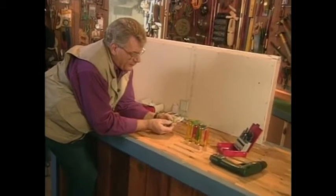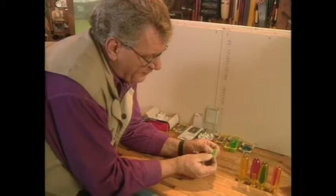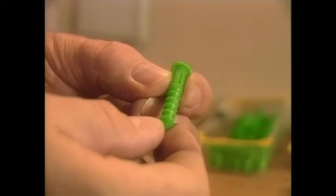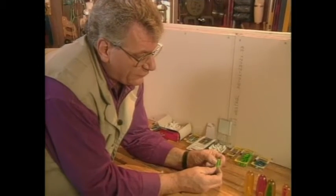Here's another type of plastic wall plug used as an anchor. As you can see, it has fluting on the side as well as ribbing on the bottom — heavier duty, yes, but still not truly heavy-duty by any means. They're installed exactly the same way: approximately a quarter inch on the shank and up to three-eighths of an inch at the top. So we'll drill a quarter-inch hole and tap that in.